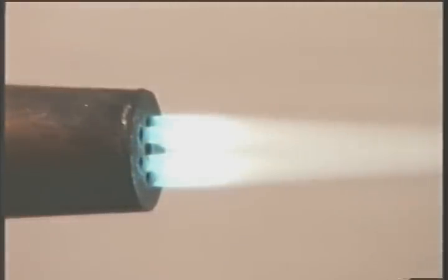If you don't add enough oxygen, the preheat flames won't sharpen up. This is called a reducing flame, and there's an excess of acetylene that will slow down the cut and mess up the oxygen cutting jet.